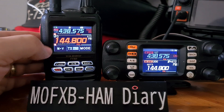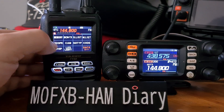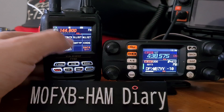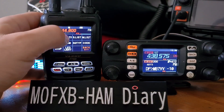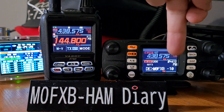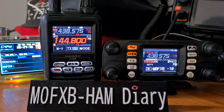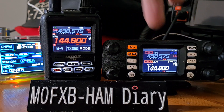To transmit, tap the F button and you'll see 'Beacon TX' up here. If you're further forward in the menu, hit forward again then go to Beacon TX. You can see it's come up as M0FXB-10. We're still receiving our hotspot on the A band of both radios.